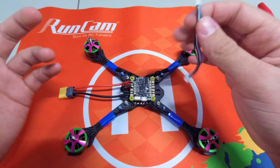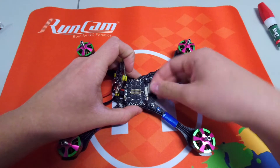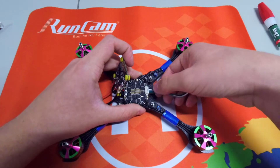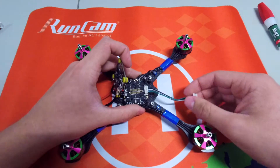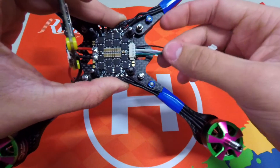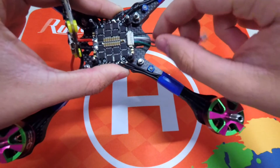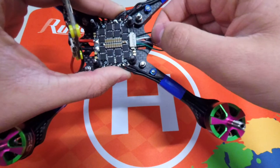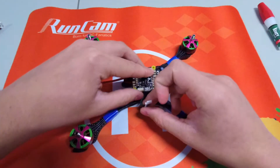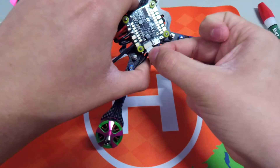The final product is this: on one end you have the CL Racing connector and on the other you have the ESC connector. To connect this, it's super simple. All you do is take the ESC connector and plug it in — make sure the wires are in the right positions. The top wire is the ground wire, and the other four are your signal wires. The one on the bottom is motor 4, and the white wire on top is motor 1. I just have it wrapped underneath the flight controller and plugged right into this connector.